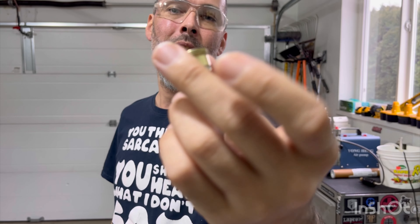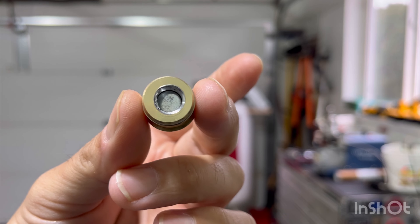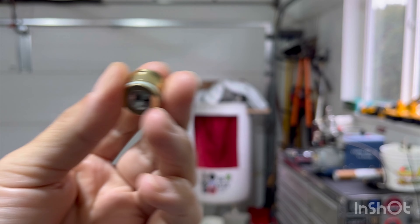I never did the calculations before — I was just watching numbers. I will do those calculations this time. I've decided to stop at 1.6 for now because I have this end cap from one of the early versions. I drilled right through it, tapped it 1/8 MPT, and put a plug in it. Essentially I've gained a little volume. The 1.6 has reduced the number of shots, and I don't want to reduce it too much because that cap is going to play a major part in getting higher velocity. I don't want to overdrill it and then put the cap in and find I've shorted myself.